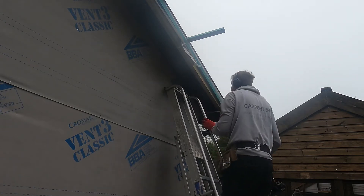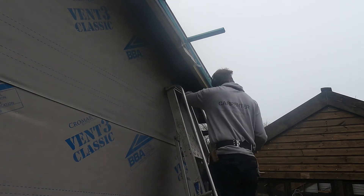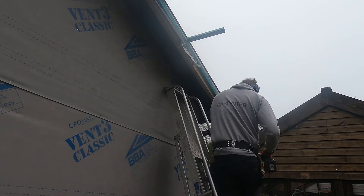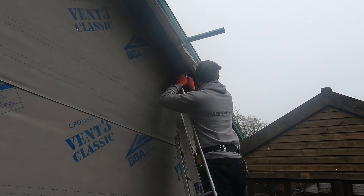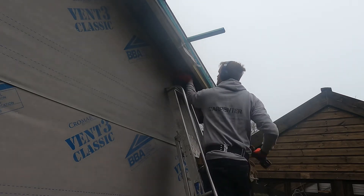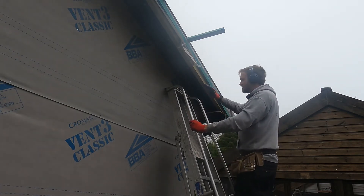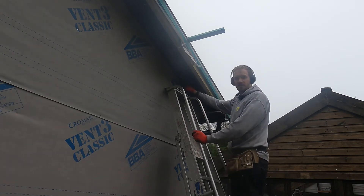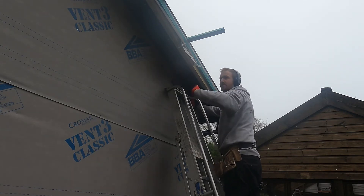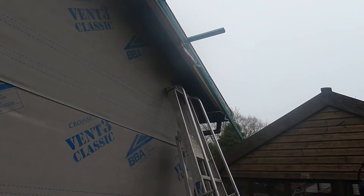It's pushed up — lovely and flat all the way up through there. When we come to put our cladding on, we can cut all the angles and mark out what's called the going. Once you've figured out your lap — the lap is given on these boards — you can work out the diminish on all your runs. I'll cover all that when I come to do the cladding, which isn't for a while yet, but you can see the basic principle.